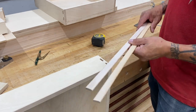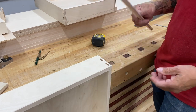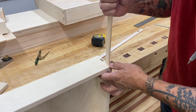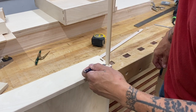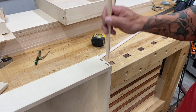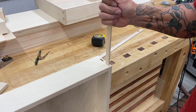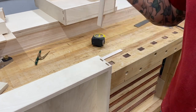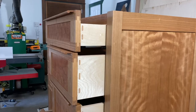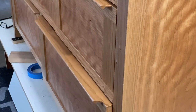So I make this stuff in length — long like this — but I make tons of them when I make them. I have these from jobs in the past and they're always going to fit. Boom. I'll cut those a tad long, cut a couple of glue grooves to let the glue escape, and yeah, that'll greatly reinforce that corner. Since these drawer boxes were made of Baltic birch, I just use maple to keep it subtle, but you could use a contrasting species as well.